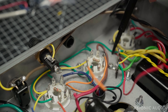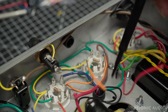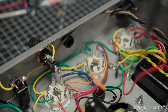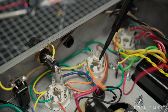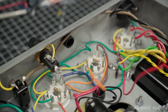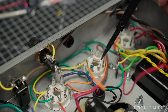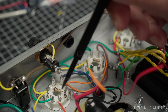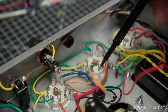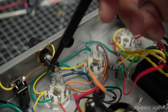The green wires here are 18-gauge Teflon-coated silver-stranded wires for the heaters. Notice they're not tightly twisted here — it doesn't matter on these output tube sockets. I could have just done straight wires from here to here, but I think this would have required more flexibility. I'm going to remove these grid resistors — grid stoppers — that I added. Because I was running them from pin 1 to 5 the way they were before, I think it would be better to run the grids on this side and then go to unused pin 6 to 5, like you'd find on some other Fenders from the similar era. So the grid stoppers will just be mounted here — no need to bring the grids over here by the power stuff.